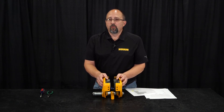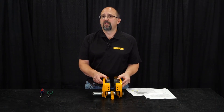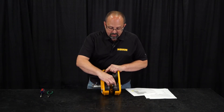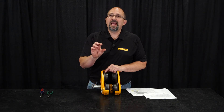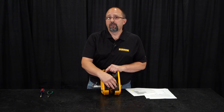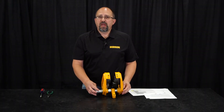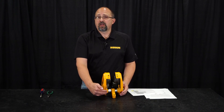If you have one of those flanges, for trolleys up to five ton, the important part is that the trolley can't open up too much to come off the beam. Keep the trolley pulled apart and measure from the flanges on the wheels — that dimension should be about an eighth of an inch greater than your flange width for up to five ton. From eight to twenty ton, the distance between your wheel flanges should be approximately a quarter of an inch greater than your beam flange width. You may have to move spacers from the inside to the outside or vice versa to fit flange widths not included in the owner's manual. That concludes our segment on manual trolley adjustment. Thank you for supporting Harrington and thank you for watching.